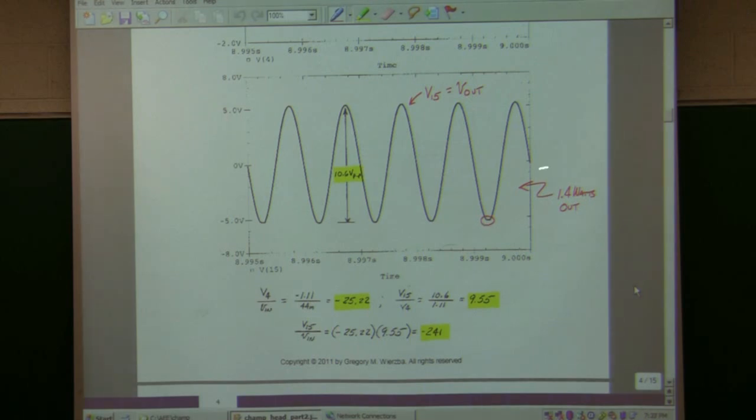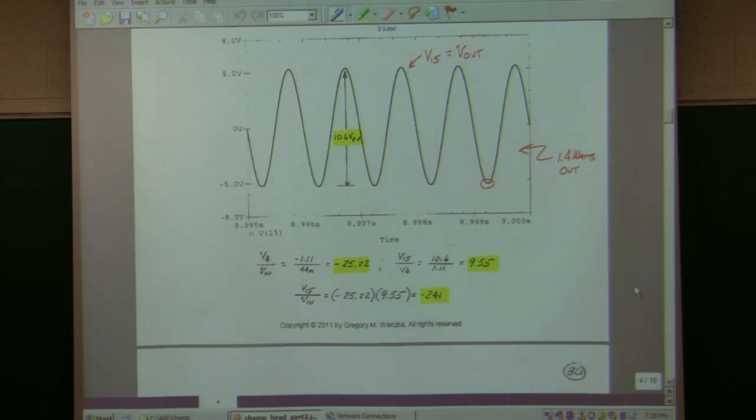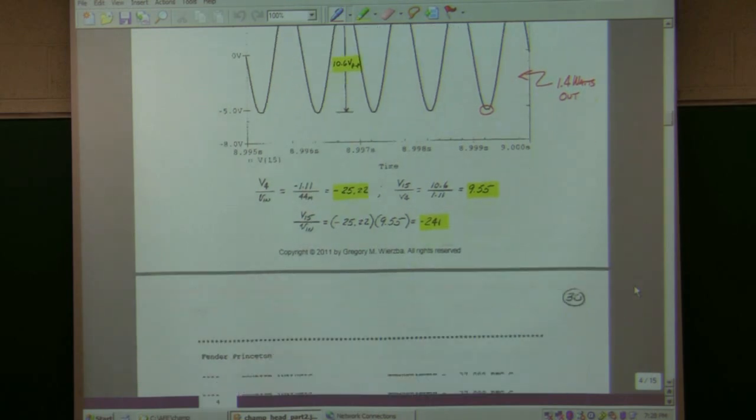I just did it about an hour before I came here. But that's the advantage of simulation. I'm able to take some of the data that I need to do some of the calculations, and I can calculate what I would need to get it to work. I was surprised that the transformer we picked was only giving me about 1.5 watts out.